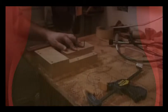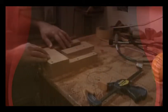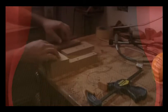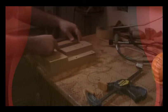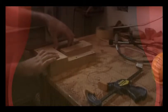I have this little piece with a couple of screws in it, and that is what I use to clamp it down. What that does is it keeps this piece in here and keeps it from coming up, because that's going to be the tendency when you use the spiral cutter - it's going to want to suck this piece up. Every now and then when I have an odd sized bridge I'll shim this with a piece of binding strip or another little piece of wood to make sure it's in there and rock solid.